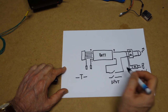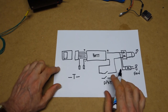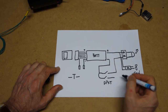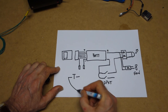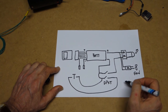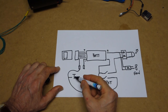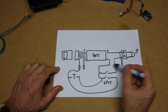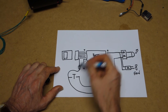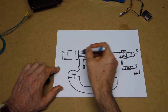That's fine. Need to make sure that we can now power this low voltage indicator. So what I've done is to loop across the back of this double pole switch, and then this switch here simply sits across that one, and then we connect this simply into there. So pressing the button here allows the negative line to be made through to the actual low voltage detector momentarily. All the other lines are permanently connected.